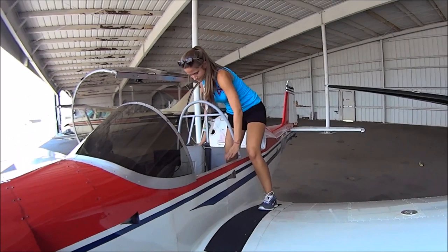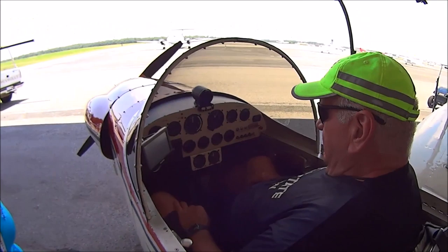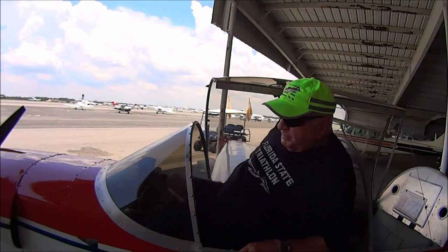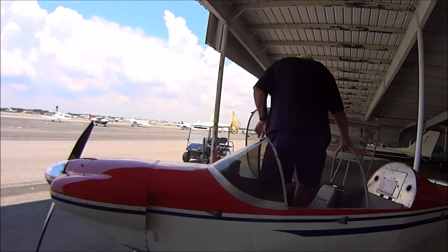Mine has a mechanical fuel pump built in, which is what I fly on all the time. If it were to fail I could switch on an electric pump, so it's got two fuel pumps. It also has two alternators, each about 20 amps. It's best to run on one at a time, so I alternate monthly between them. It's just an incredible engine.